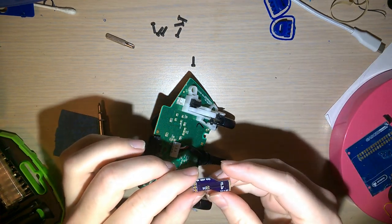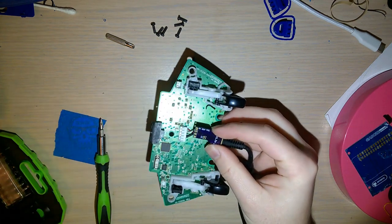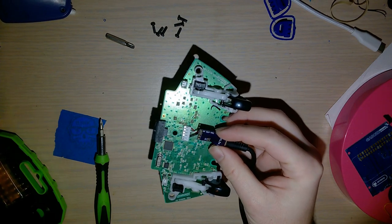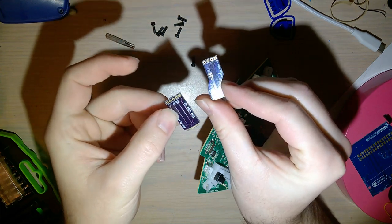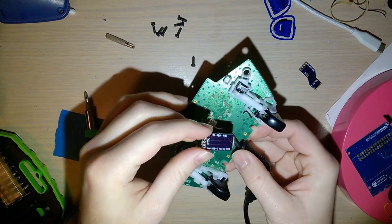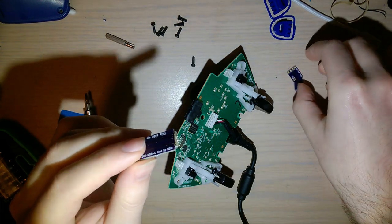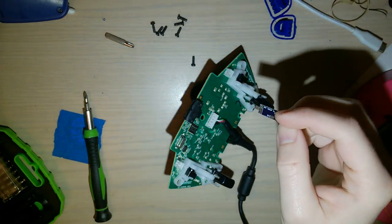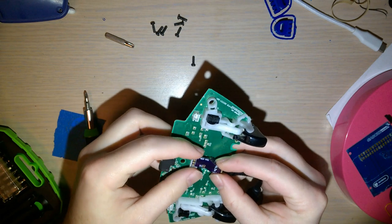First, I want to double check that this fits properly, because the original design, I actually have one somewhere over here. This is the original 1.0. You can see it's straight instead of the curve, and so the port itself doesn't end up in the right place. I accidentally ordered these boards too thick, so they wouldn't work anyway. These are the standard 1.6 millimeter, but you need to get the 0.8 millimeter thickness boards. Anyway, before I get distracted again.